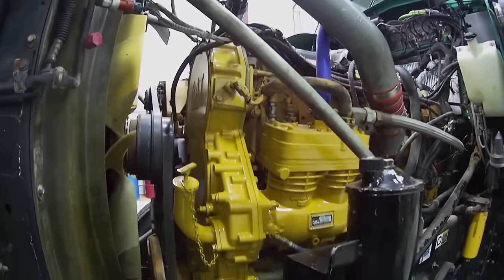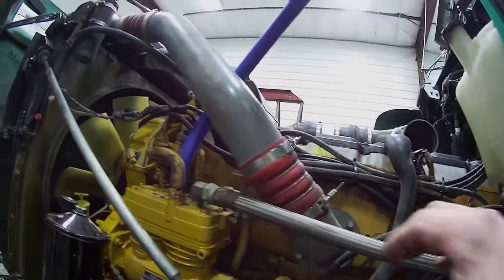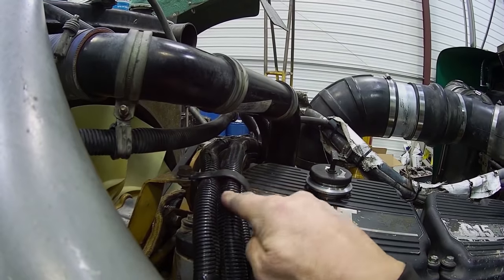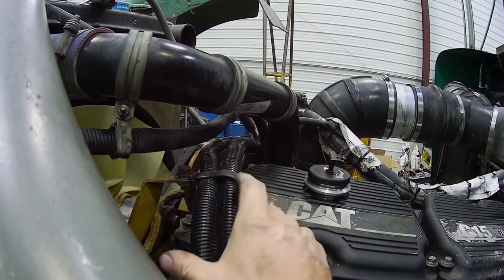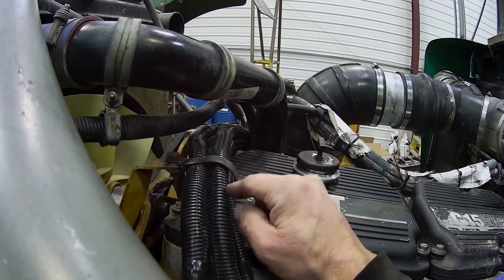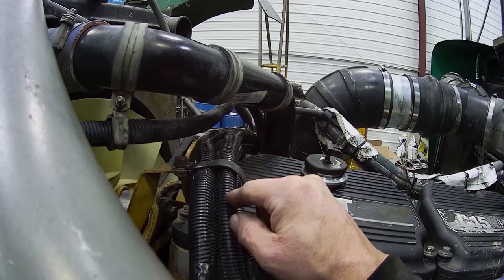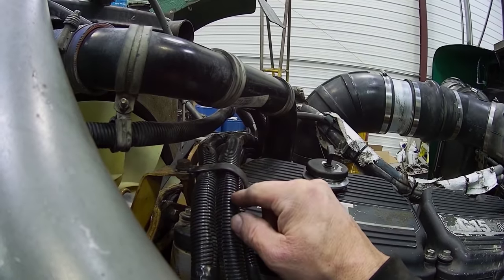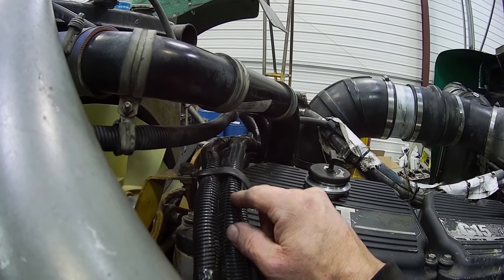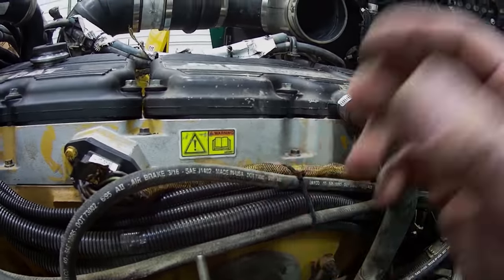Okay, I got the compressor on, and I painted this front cover where the paint was gone. And Jake has taken off all the old wiring loom over to the alternator and everything, because it was so cooked and falling apart. So we separated the hot from the ground, and they're in separate looms. Didn't want the alternator battery cable to short out there, because that'd be like a 145 amp 12 volt welder, and it would start a fire for sure. So we've got that all redone, clear back into here, and we got things tidied up and tied down.